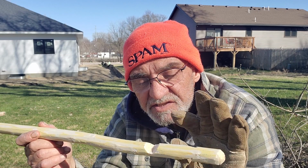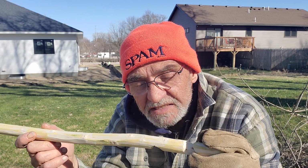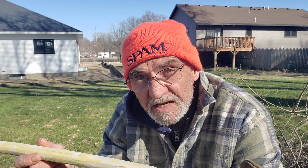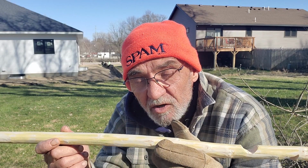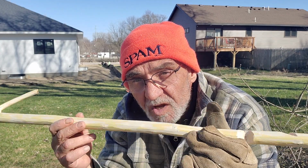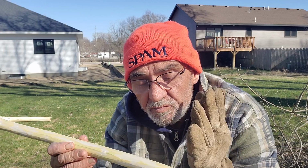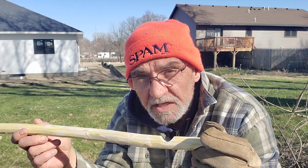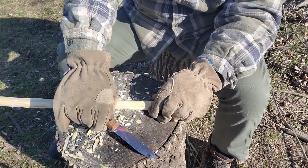The difference is this round it off and it looks nicer. The saddle would be used maybe at the top and at the bottom, and because there are no round edges on it, you have corner to corner, it doesn't roll. The log can't roll at all when you put that other one on. So it is a better notch for holding logs. And this is the saddle notch.